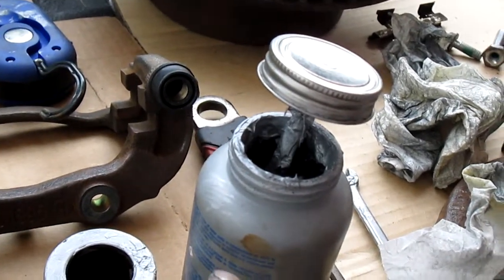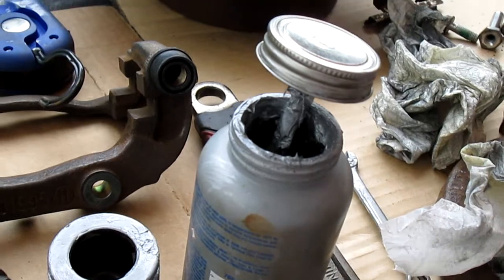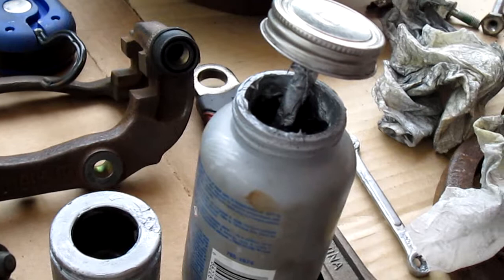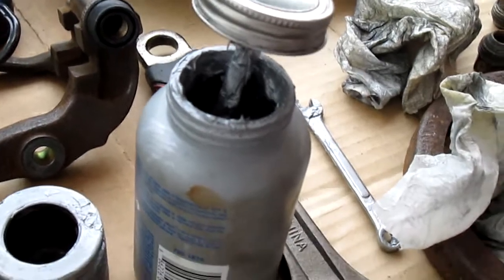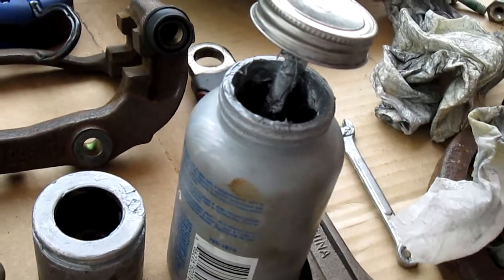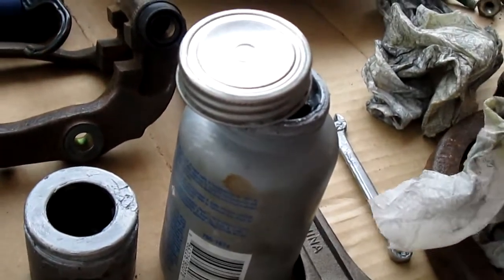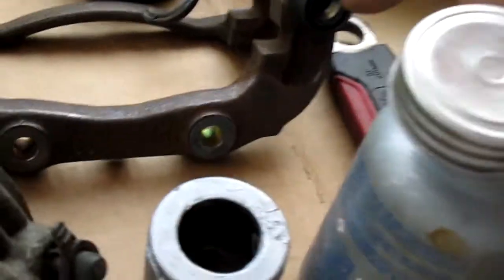What that does is — silicone will hold high heat, it won't adhere in high heat. And the grease will also hold high heat — that's why I think that's what they do. So if you take one spoon of anti-seize and one spoon of grease, mix them together and then fill these holes with them before you put the pin back — fill that up, and that's what keeps it going in and out.